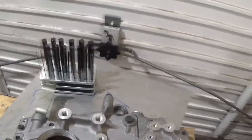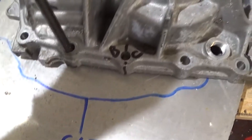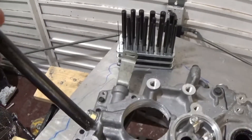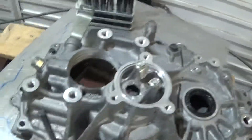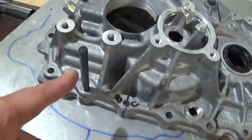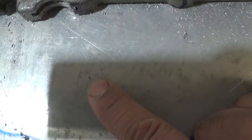So these are the drift punches I was talking about previously — this is a metric set. What it is with these is you find the dead centre of the holes. You get the one which is pretty much exact for the hole, pop it in, then give it a tap — these have got a point on the front of them and it should give you the centre of the hole. I'm thinking to drill the first one, drop that in the hole, then maybe drill a second one at the opposite end and drop it in, then hopefully it won't move and I can go ahead and centre punch all the holes. I'm going to punch that one first — I'm going to commit myself and tap it down. That's my mark for my first drill point.